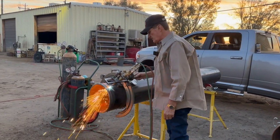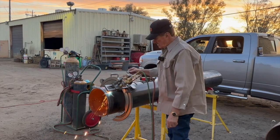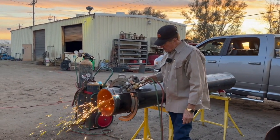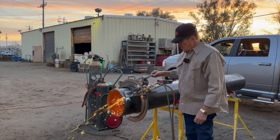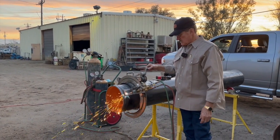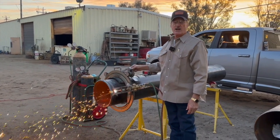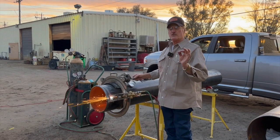I'm looking down at this, and that little track where they cut the metal out — that little space should be clean. There shouldn't be a lot of slag coming back, or it's fusing again. If it is, that means I am going too slow. But most of the time, especially when you're learning, people go too fast.